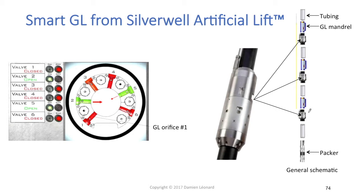You don't have to calculate any casing opening or closing pressure or valve calibration pressure. You just start injecting your gas lift, and once you see that your casing pressure at smart gas lift module number one is higher than the tubing pressure, you just open your valves. Once the casing pressure at module number two is higher than the tubing pressure at module number two, you open the valve there and close it on module number one. All of that can be decided at surface by reading the actual pressure from the gauge, making it very easy to operate with precision. Once you reach your final smart gas lift module, you can adjust the orifice size to reach the critical rate.